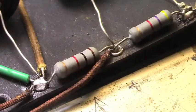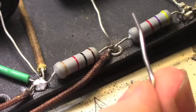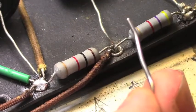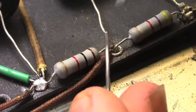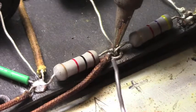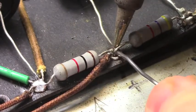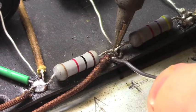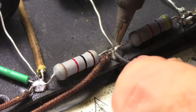now here's where soldering technique comes in. Okay, I'm going to put a tiny bit of solder on the iron itself and then give a little bit of a wipe on the sponge. That's tinning the iron. Now I'm going to hold it on the work, meaning all the components in the eyelet. Eventually you'll see the solder will start to melt against that eyelet.